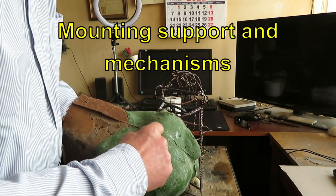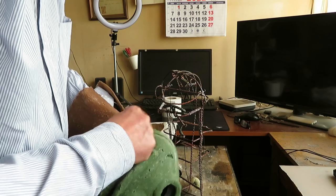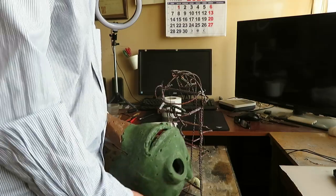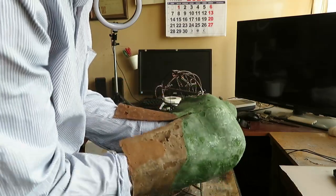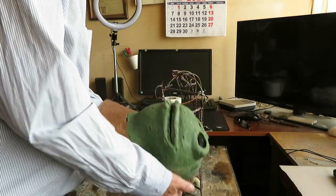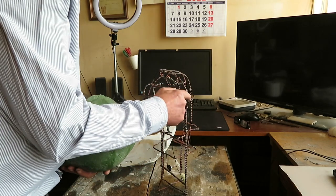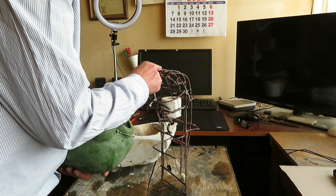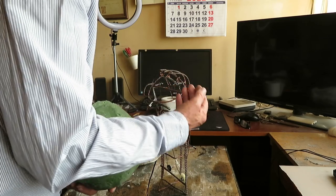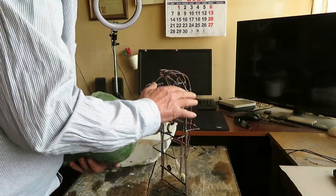After sticking all this section round to there, I think it's the moment to install it on its structure — it's still flexible enough to fit in there without problems. Before we put it on, we have to sandpaper all the connections with solder — any little bit that might be pointed or might cut through the silicone, we have to sand it off and leave it perfect.